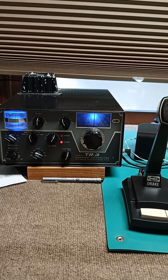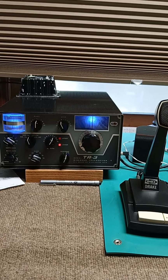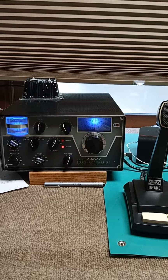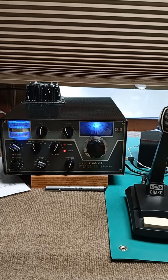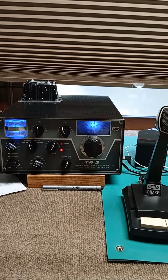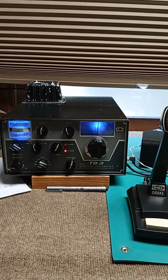The fact that the balance modulator uses microwave diodes means that the stray capacitances went way down. So the original design had a 3.9 picofarad capacitor on one side of the bridge, plus a 1 to 6 picofarad trimmer, and that capacitance had to be reduced by putting an inductor in series with the piston trimmer. So it tuned in perfectly. Had to slightly adjust the 1K pots in series with the bridge, but that resulted in literally about 50 millivolts of unwanted carrier signal and some mixer products at the final grids. So that is essentially perfect.